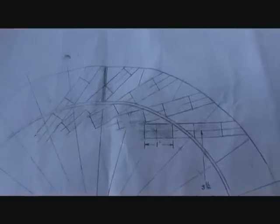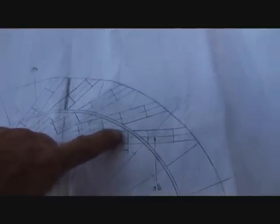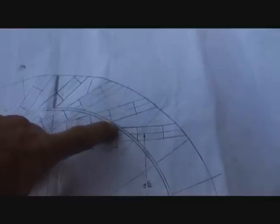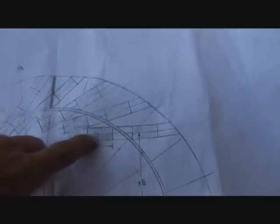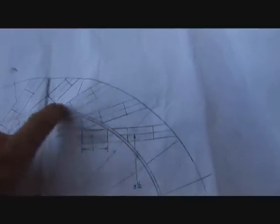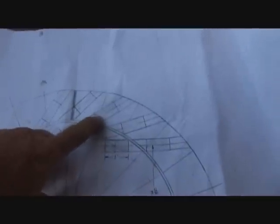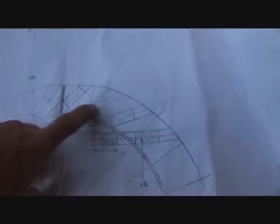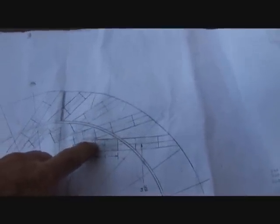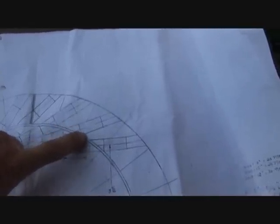This configuration does not work because of the amount of negative forces between the magnets as they're passing by each other. Right here, the length of these magnets causes this magnet and this magnet to push away from each other, even starting at this point over here. So reducing the length of these magnets creates the opposite effect, where it starts sucking into this field.